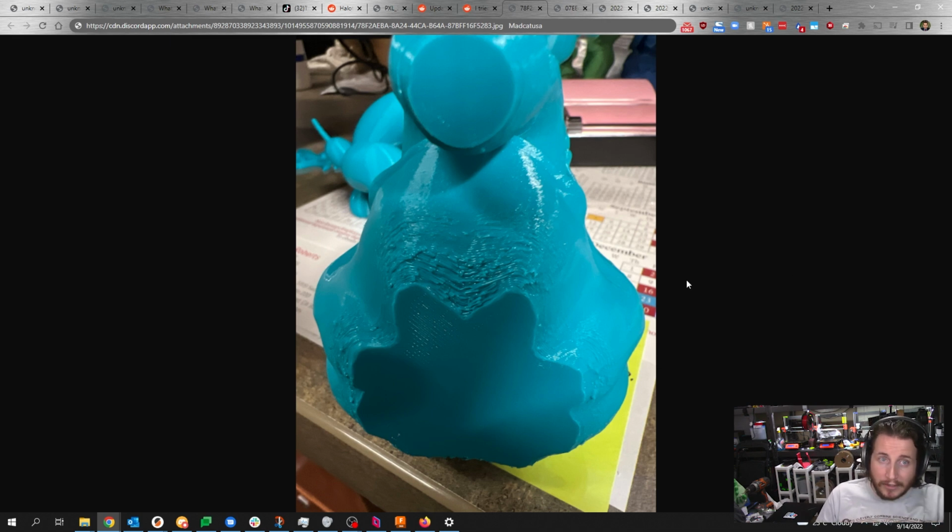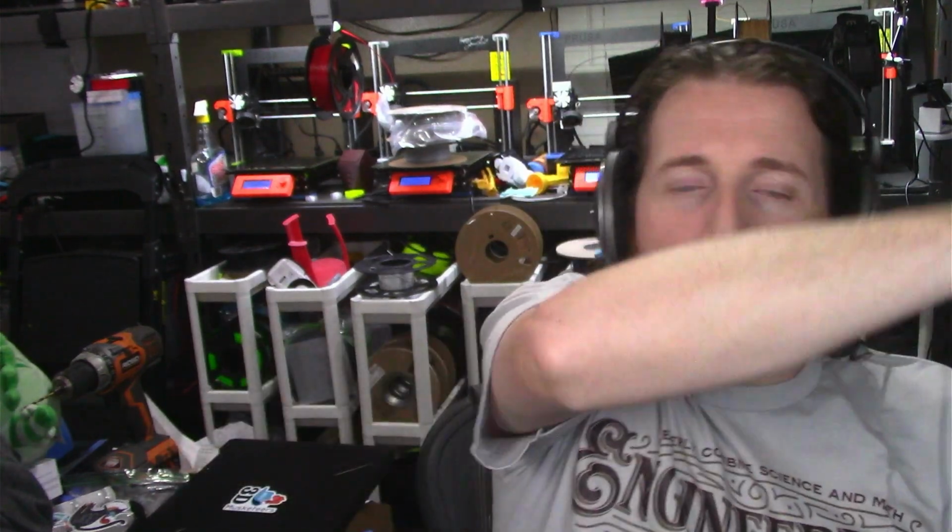Now, he is using an Ender 3, which notoriously don't have great cooling. If you're not using an aftermarket cooler with your Ender 3, you will be limited not by your hot end for speed, but by your ability to cool the layers. And if you put down the plastic so fast, there's not enough time to solidify that layer before, even PLA, when it's hot, does shrink and can warp a little bit. If you don't basically set it with the fan in place before it can warp, it's just gonna warp on you.